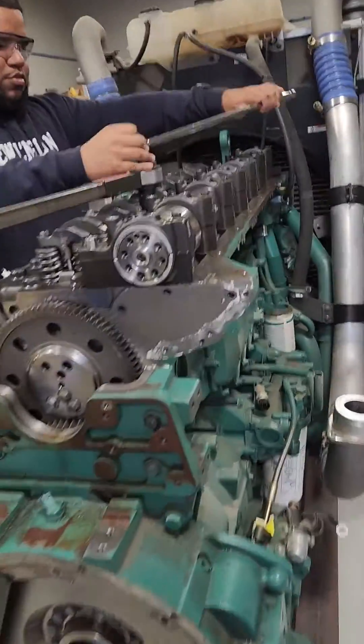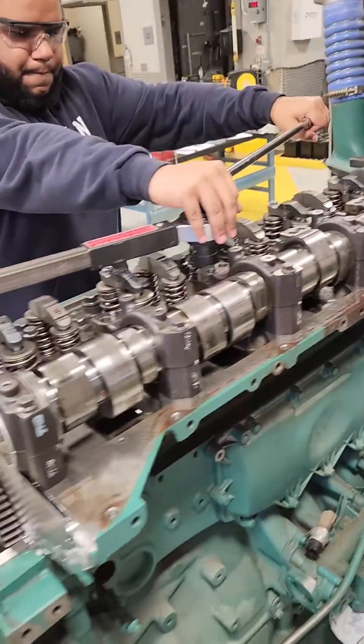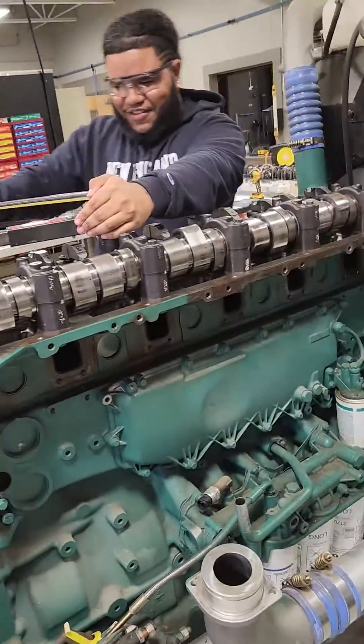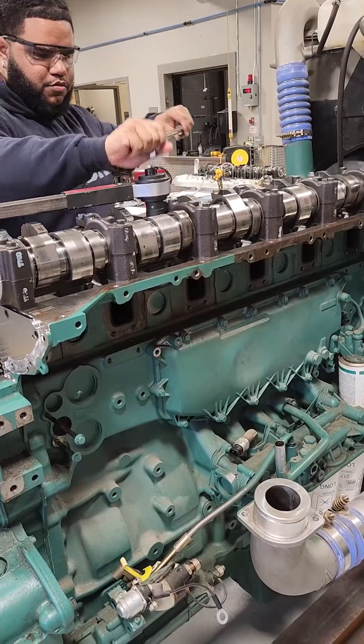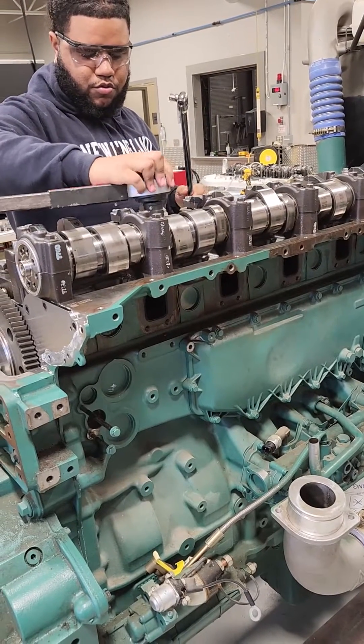Using a torque multiplier gives them the mechanical advantage — if you haven't ever seen this before, it is a must have tool. Told you to hold that against the bracket; you could hold it up against the bracket of the engine. So we're loosening these up maybe a quarter of a turn — it's probably a three to one mechanical advantage that he's got.